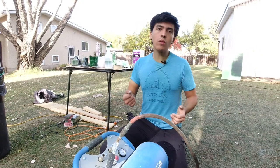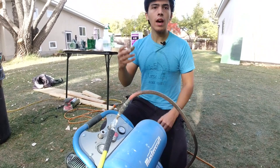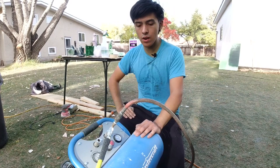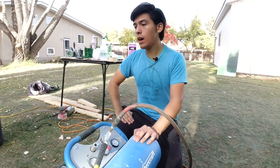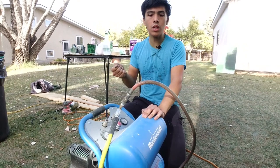So what I found, for example, is that you have the compressor here and then the tanks, so you can get good atomization for like 10 seconds, and then the tanks run out and then the spraying bogs down, and suddenly you're spraying barely any paint out once the compressor is actually just pushing you along. Doesn't hardly matter what pressure you're using even, it just isn't moving enough air. And so you slow down your painting, and when you slow down your painting, you're there all day, and you wait for the compressor to pull its tanks back up. That's like 30 seconds that you're waiting for your air compressor to get you back to where you need to be. So given the size of this job, very quickly realized we'd have to do something very radical.